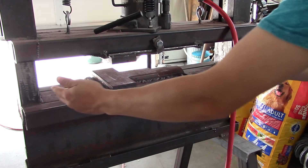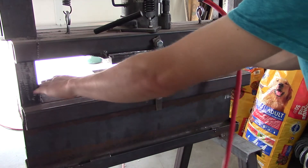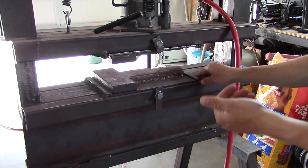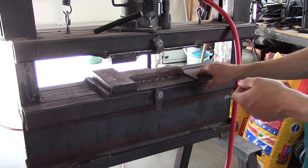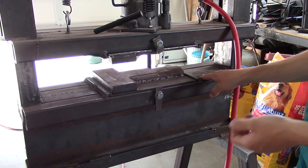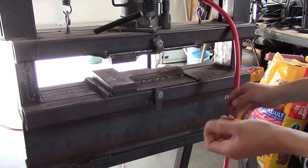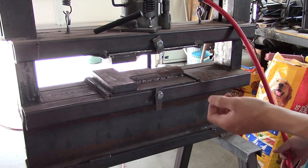I made my press with a berth of 26 inches so that I can fit a full metal brake in here, so that I can shear, bend, any type of sheet metal up to probably around an eighth of an inch. Just so I can play around with plate for fabrication purposes.